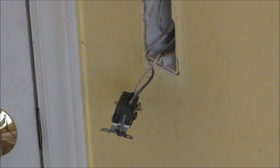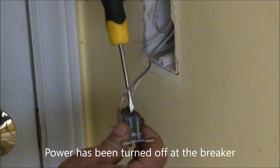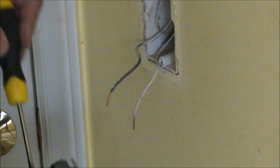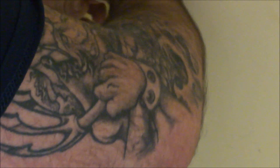The first thing we'll be doing is replacing the wall switch. This is the old standard wall switch — power is off, I've verified that — and the release of these is quite simple. You really need a screwdriver with a pretty fine tip that'll slide in there. I've got some black tape that I'm going to put on this white lead. This is technically a hot lead; it shouldn't be white. It really should be black or some other color other than white or green.